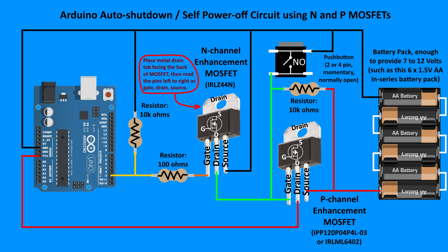Here's a schematic I made of the circuit. As you can see, it uses an N-channel MOSFET on the left and a P-channel MOSFET on the right. You'll notice there are two different models listed for the P-MOSFETs. That's because I tried using the circuit with two different kinds of P-MOSFETs, one of which was a surface mount MOSFET. I'll go through more detail on this in a later chapter in the video if you're interested.